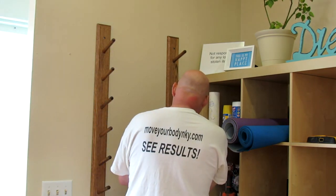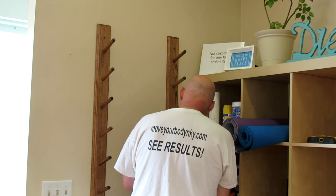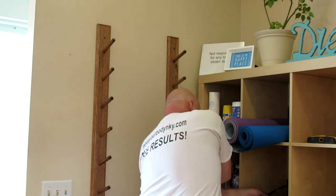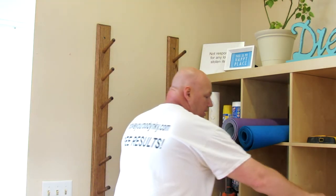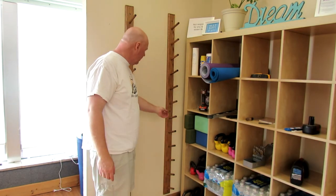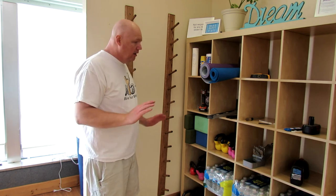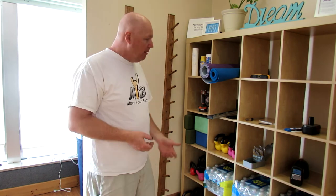I'll put my bolt in, get it started, then take my gun and zip it in — now that's going to hang there. I'll check it for level again: perfectly level. Now we're just going to take our level sideways and make sure that it's plumb straight up and down. Once it's plumb, repeat the process — use a nail set and pencil, mark the hole, drill your half-inch hole, run another set of togglers in there, and you're finished. I'm a fan of these togglers — I've got them on my ballet bars and ladies hang on them constantly and they've never failed.